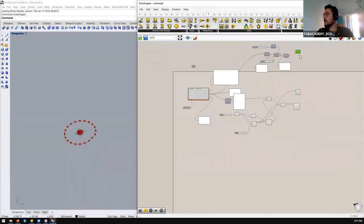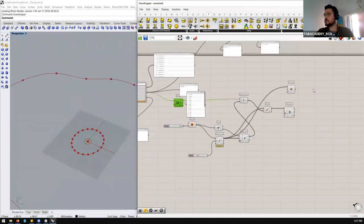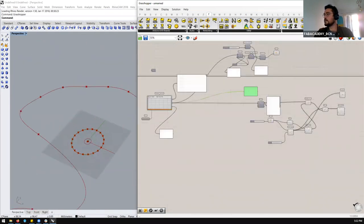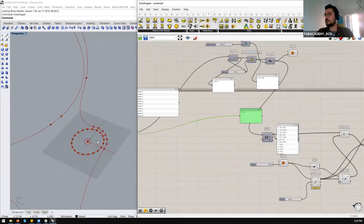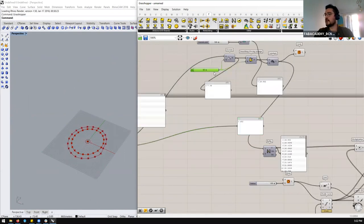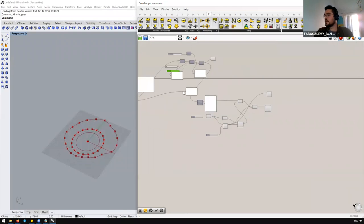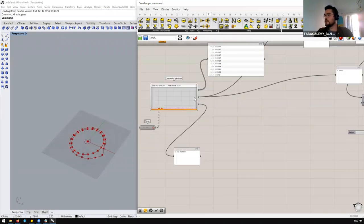We have the constraint for the internal values so numbers don't get out of range. Ideally, to have everything under control, we set up constraints as we did before. The values are changing, but we're averaging too much — I'll reduce to 7 samples so the sound changes faster. We can do this with sound, or we can also do the same with an ultrasonic sensor — it's just data.